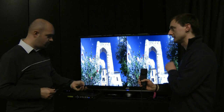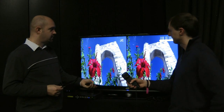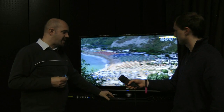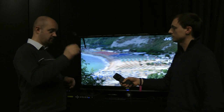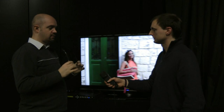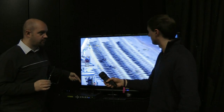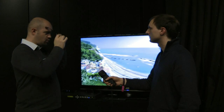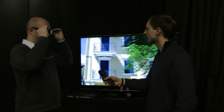This isn't a regular plasma TV — this is a professional monitor. So this turns it into a stereo system like this. This is a passive display based on these glasses, like the real D-type, which is effectively a polarized system — circular polarized. There's a filter on the screen itself which polarizes every other line one way or the other, fitting into one eye or the other. So as you put the glasses on you get stereo into your eyes.